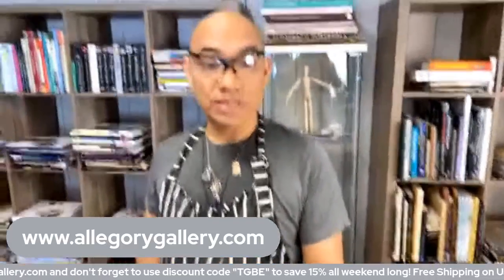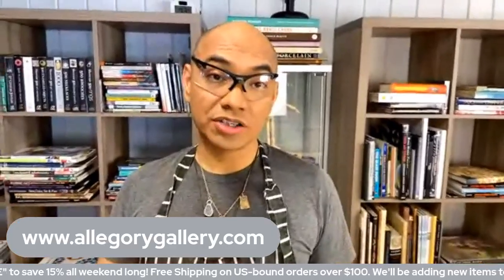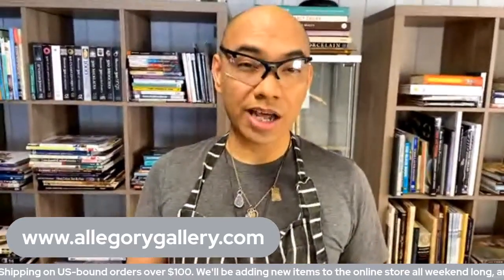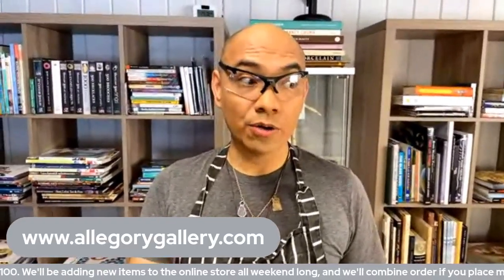And the reason why you're gonna be sad is if you're metal on metal, it basically is like a hammer, but on the underside, and it's gonna take your texture off. And this texture is not super deep as it is. So you want to protect this texture. And one of the ways that you can do that is using a wooden dapping block.